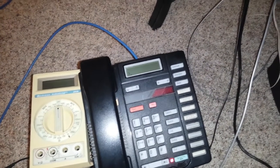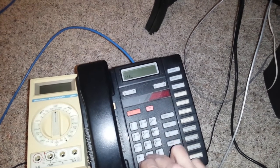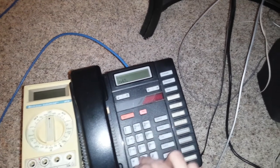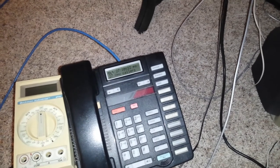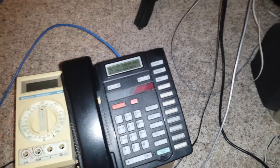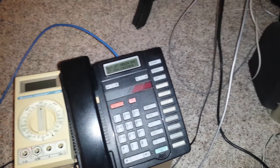But my phone line does work this way. I can call things. Somebody must have busied out a milliwatt, but I can call things. The CO interprets my DTMF seemingly just fine. There's just a lot of hum. It's kind of hard to hear over on long distance calls — they've got an extra 6 dB drop in there, and so sometimes it can be hard to hear things over the hum.